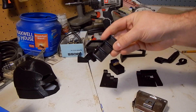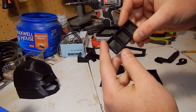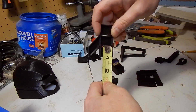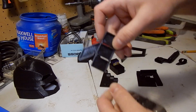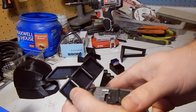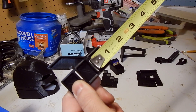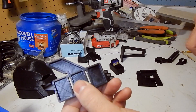One of the next things I printed was this little jig for measuring miter joints accurately. The way it works is the end of your mitered piece of trim goes right in here — that's where the 45-degree nose goes. Then you take your tape measure, it goes in this slot, and that allows you to measure from the outside of the mitered joint. But also, if you put this on the obtuse part of the angle, you can measure from there as well. I've never seen this before, but the next trim job I do will include this.